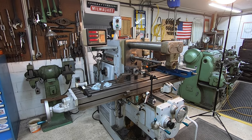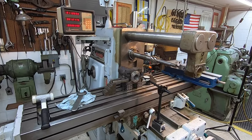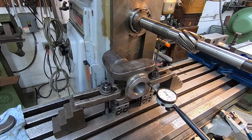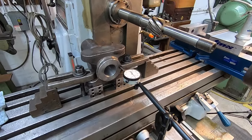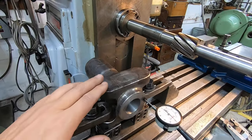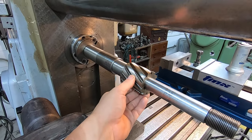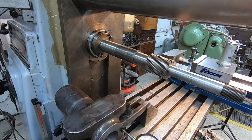Okay, well, we're getting our Fairbanks crosshead set up in the horizontal here to finish out our milling ops. Just initially getting it set up. We still got to indicate. You can see my setup here. So my plan was, we'll machine this right there. We're going to use the horizontal arbor. We'll probably just use this rough mill, and I'm not set yet. I'm just trying to make sure everything's positioned where it needs to be.